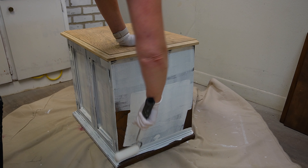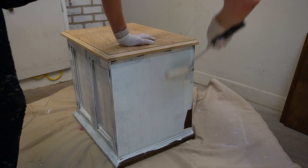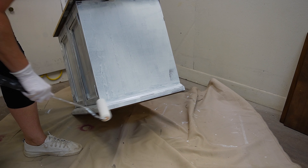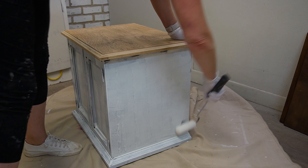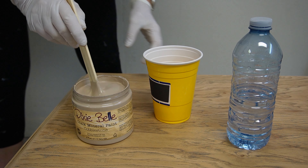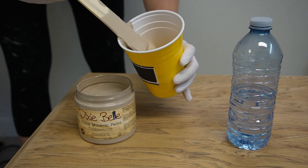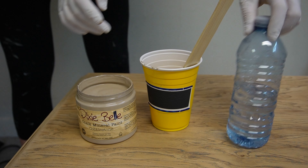I could tell the trim was held in place by trim nails, so I grabbed my painter's tool along with a furniture mallet and started hitting it to try and loosen it up. As you can see, it didn't really work out that great. Then I went in with my screwdriver, but that did more damage than good. So I got my pry bar — not sure why I didn't do that in the first place. I went and picked up my pry bar and started prying the trim loose with the proper tool. When using the pry bar I also like to put a shim of wood underneath it so it does not damage the door frame, because I've done that too many times in the past and it just causes excess work.